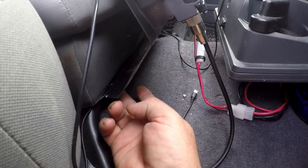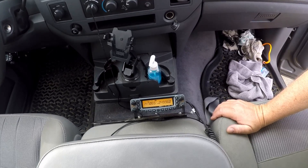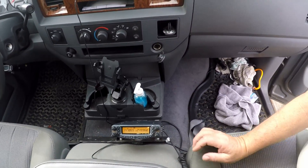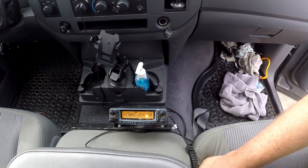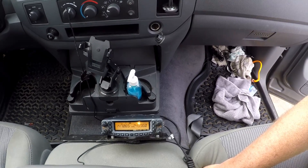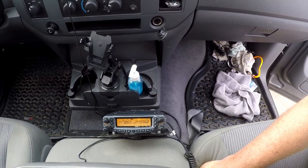What it does is bolt down underneath - you unbolt it, slip this in, it's got a couple of slots, and then there's my coax hookup. It shows the voltage of the battery, usually around 14 something. I've made some pretty good contacts with this setup distance-wise. Going down to LA for the Mount Pacifico event with Josh and the Ham Radio Crash Course group, I made a couple contacts in excess of 50 miles on simplex. I usually run 520 down the freeway just to listen and call out every once in a while.